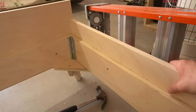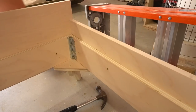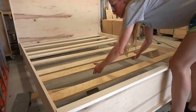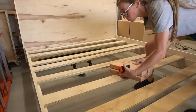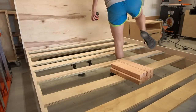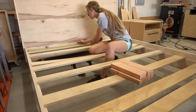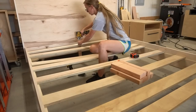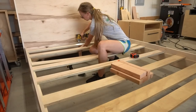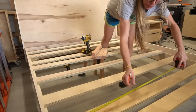Once the brackets were installed, I used remaining plywood to rip some strips to use as the slats. This design allows you to skip a box spring by using slats, but these also need to be supported in the middle. Rather than a 2x4 running from head to footboard, I prefer to add 2x2 pieces in the center from the slats to the ground. I marked the center of each slat and screwed a 2x2 in at that point.